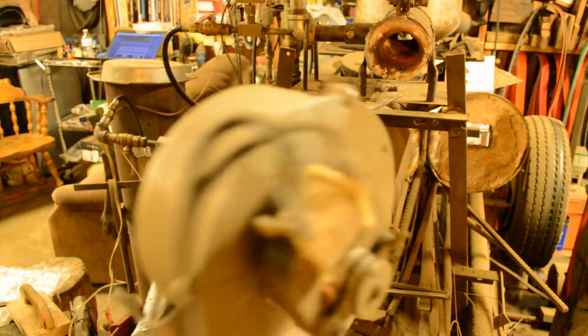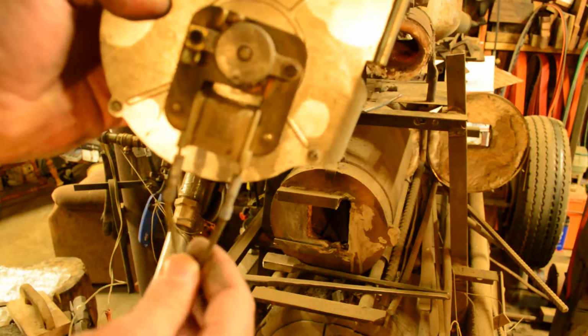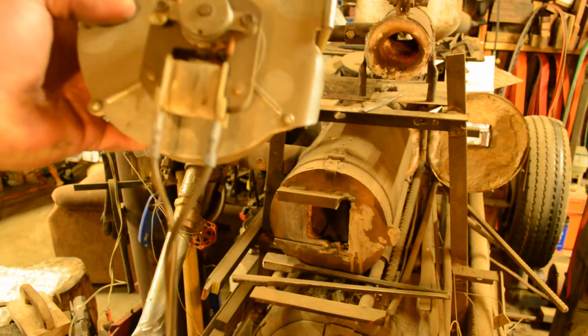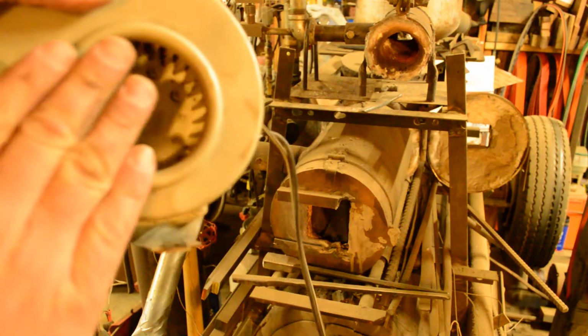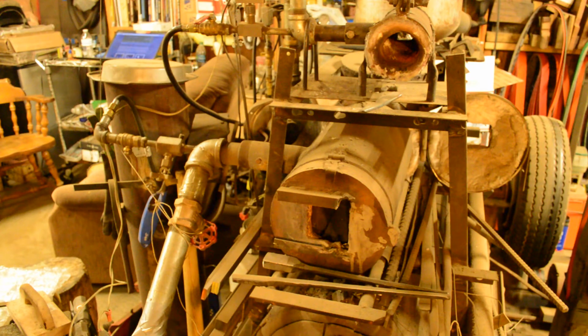Here are your 2 connections where you put the hot and the cold side, or hot and the neutral side of your 120. Put it in there. The one that's up there has got a switch, and they just sit there and run. I don't use a dampener, like over the face of it or anything. I just control the air by the valve.